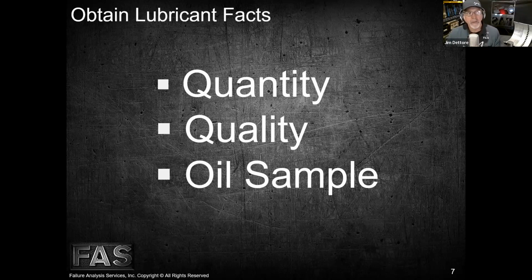They also break down the different chemical additives that are in the oil to let you know if the additive package has been depleted. Oftentimes when we run our oil too long, then we deplete that ad pack or hurt a portion of the ad pack, and the oil can't do its job properly, and we run into other problems, right? Lubrication related. So that's just a little bit about the oil samples, and we can go into that pretty deep if you want on an oil sample podcast.